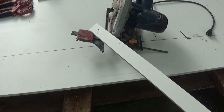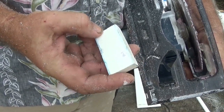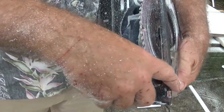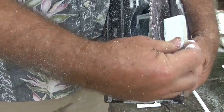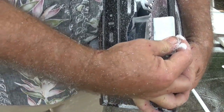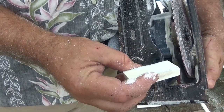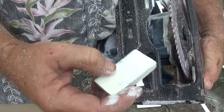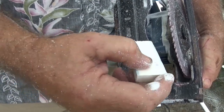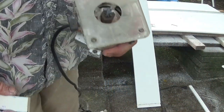Now we make a jig. It's a very simple jig with two important dimensions: length and width. The width is set by placing your saw up against a saw guide and making a strip, then cutting it to length. The guide goes to one edge, the other edge is up against the blade, so whenever you lay out something you don't have to measure that dimension every time - you just slap it up against your guide and you're good.